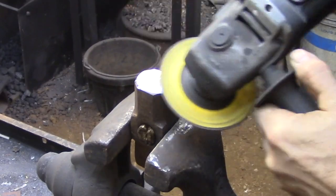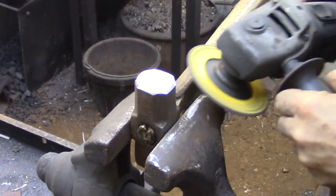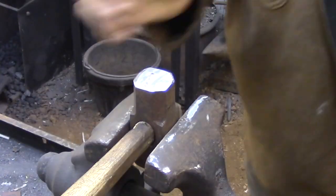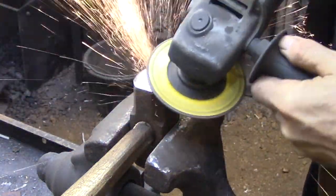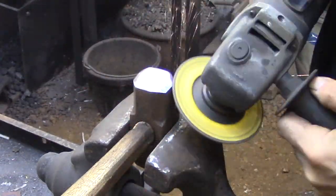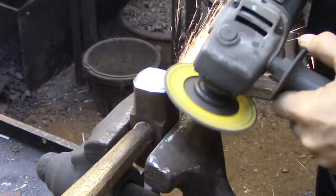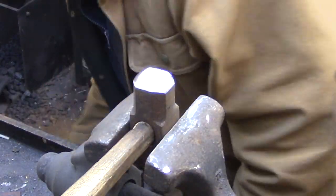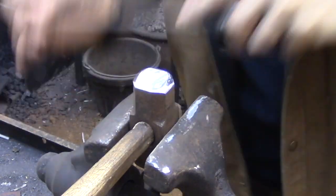As you can see this hammer head is octagonal in shape, so I'm going to have to compromise slightly between the ideal shape that I was after on the drawing board and the hammer that I'm actually working with. What I have here is the front and back faces and the two side faces of the hammer are exactly as I described on the drawing board. But the angled faces that join those four sides together are just going to have to be a tapered grind that goes from one radius to another — you're just going to have to blend it in as best you can.